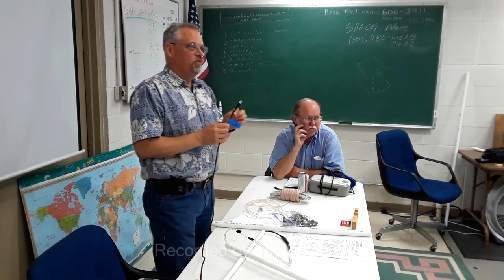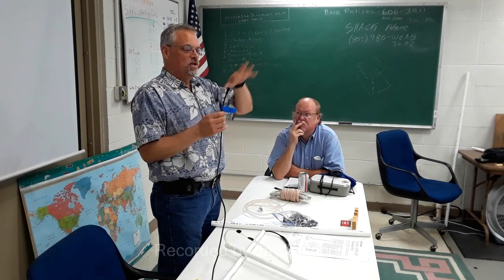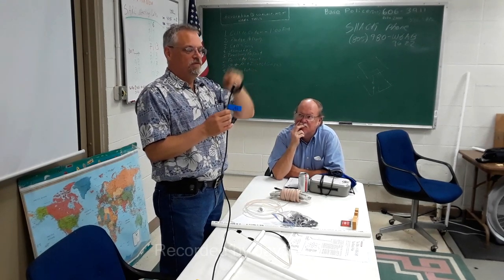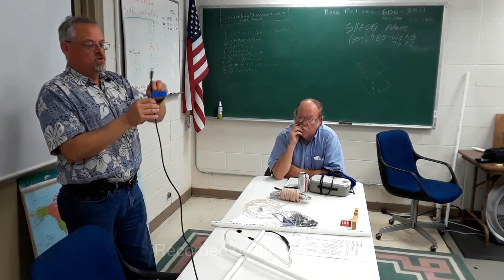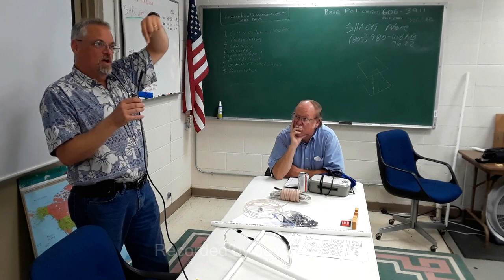Now, if there's an imbalance in your system, so if you have a fully balanced antenna, there should be very little current coming back. And if it's tuned and balanced, you should have very little reflected energy coming back. But any of that current that is being reflected, we want to encourage it to go down the inner, not on the outer.